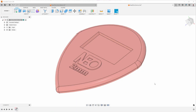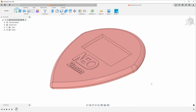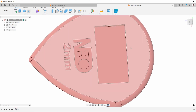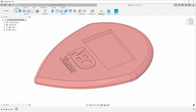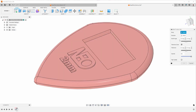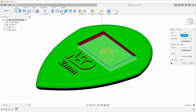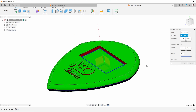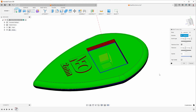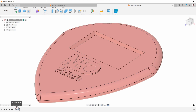This is the 3D CAD file I got from Justin — it's pretty straightforward and fairly simple. There are a few things I like to do when I first get a part. The first thing is to check for draft. I can look at this already and tell there's no draft on these walls, but there's a nice tool in Fusion 360 specifically for this purpose: draft analysis. I have it set up to show anything with less than 2 degrees in either direction. I select the body and then the plane that represents the pull direction for separating the two mold halves, and it immediately highlights in red the walls that have no draft. I'll go ahead and show how to add draft.